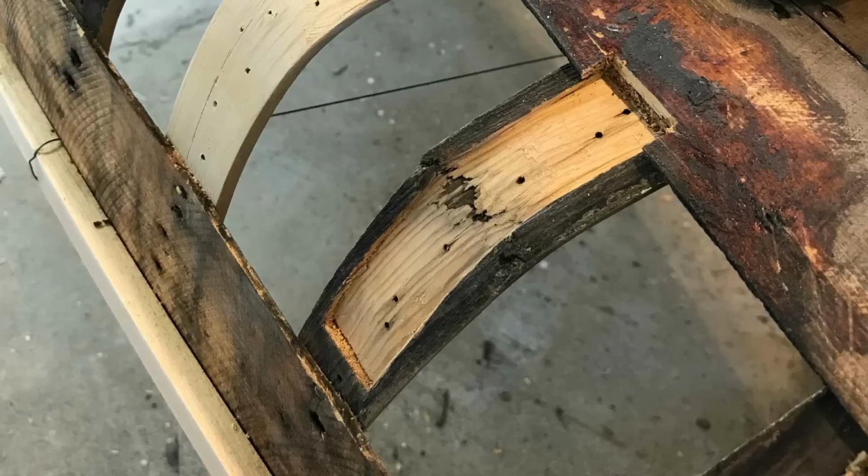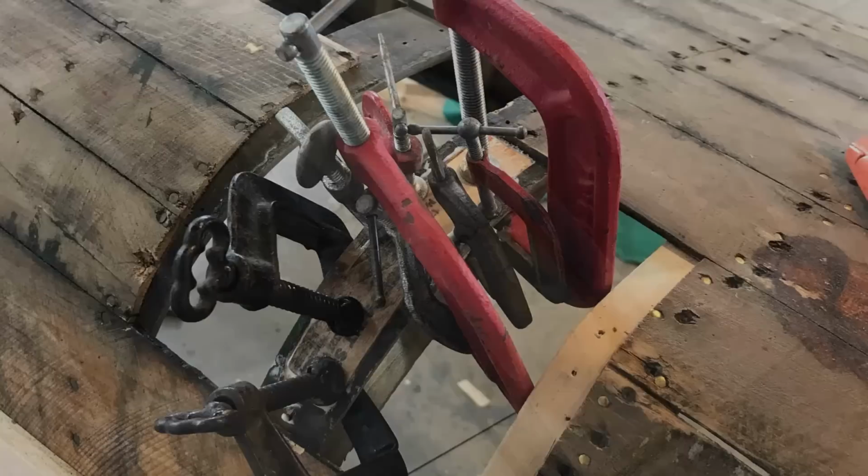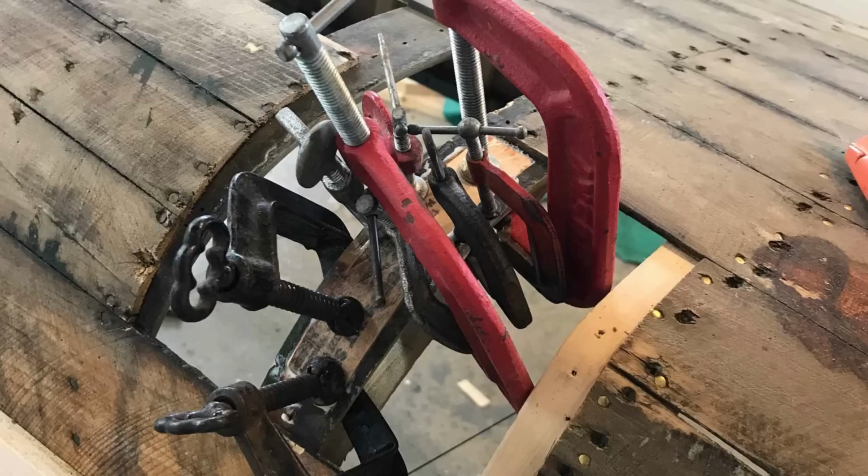First, I carefully removed the planking over the cracked rib so I could replace it after the rib was repaired. I then cut a mortise into the rib about halfway through it. I glued in a spline made out of a paint stir stick. Our local Benjamin Moore paint store gives away stir sticks with each gallon of paint, and their stir sticks are hardwood in just the right thickness and width. Using a stir stick saves time.